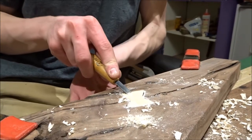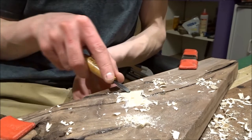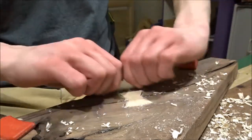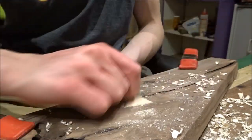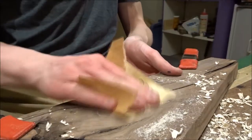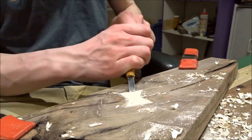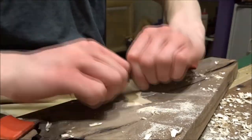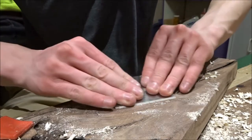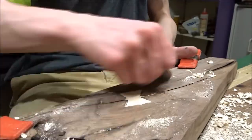Let that dry and then take either a flat chisel, sandpaper, a cabinet scraper, or really anything — and shave it down so that it's flush with the wood below it, so in this case the walnut that's cracked. I switch between using an exacto knife blade, sandpaper, and chisels, just because I can't stay focused on just one thing at a time or I'll drive myself crazy. You don't have to switch between tools — find whatever works best for you. I even used a cabinet scraper here, and that seemed to work the best; it was easiest to hold on to as well.